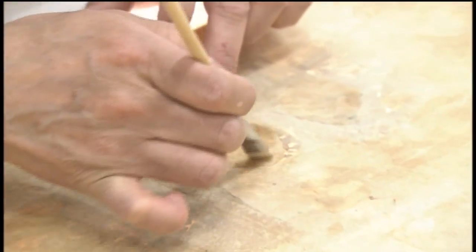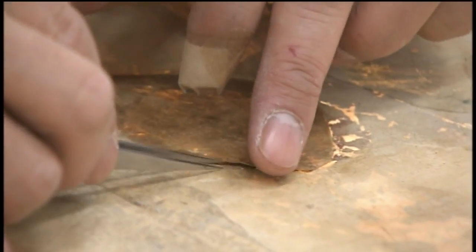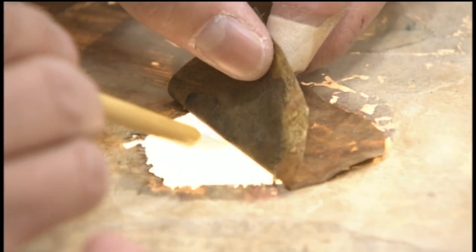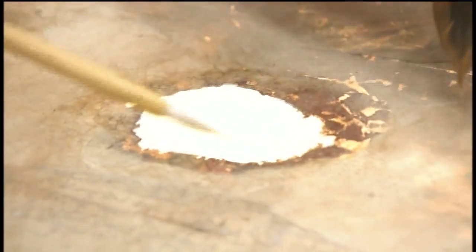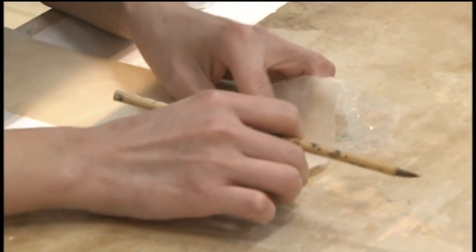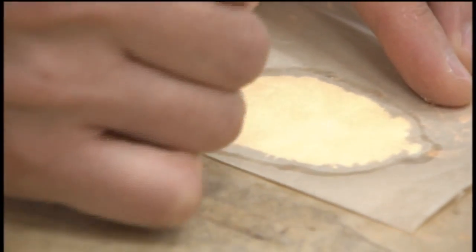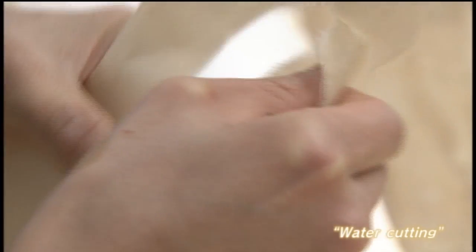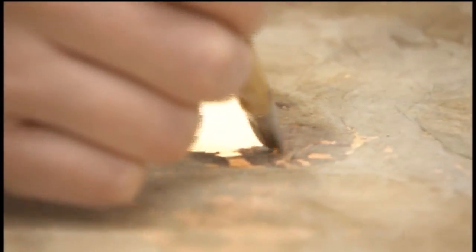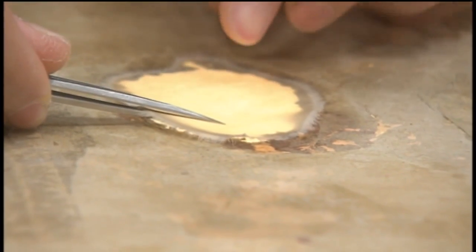The old infilling paper pasted over the finger pull of a sliding door is removed. It is moistened using a brush soaked in water and peeled off slowly. An outline of the hole is taken with water on a new piece of infilling paper, which is then torn off by hand in a method known as water cutting. This enables easy layering of the paper fibers, and the paper can be stuck on with thin paste, mitigating the burden on the painting.